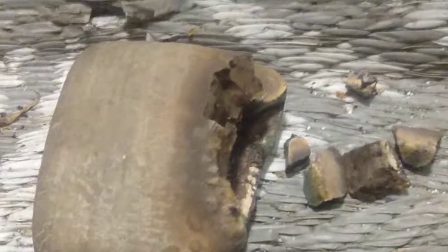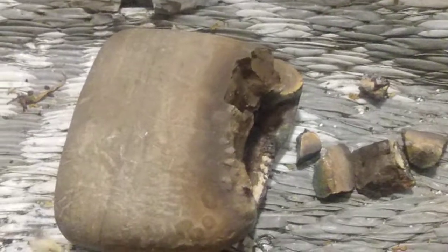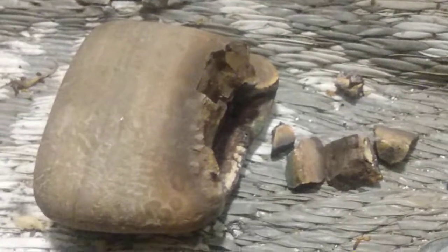And I have been measuring it after each time through the forge. So basically what I do is I put it in the forge, my little cupel here. I heat it up, get it all completely molten, add some borax, let it rise up. I'm actually adding flux at that point, because once it's melted together, I don't add more borax, I add flux. And then once I've fluxed it out and get all the crap out of it that I can, I flip it over, I do it again. Then I crush it all. I put it all back together, I do it again. I've done it about maybe 6 times now.